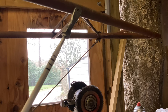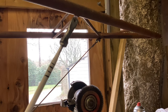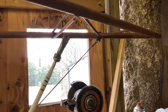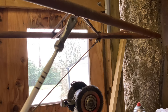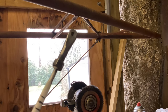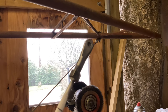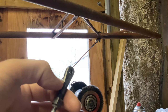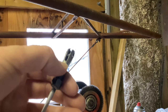Of course all the wires were marked up the same — i.e., no markings. So I've marked them now 1 to 4. Not only have I done that, but when I put the ends back on — I took the ends off completely — they all went on the same amount. So they're all on 30 turns, which is about an inch. I measured inside with a nail and the wire on all of them comes to just below the fork, which is ideal.